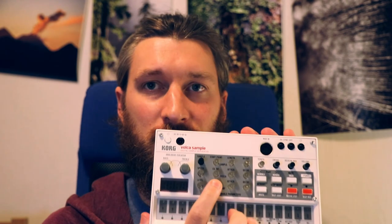There are two main compromises with using this adapter cable. The first and biggest one is that we can only record mono. There's no way to get stereo output through this because the microphone input on your phone is only capable of recording a mono signal. In terms of the Volca sample, that means we're not going to be able to use the pan knob at all, because the pan knob requires stereo. Everything else will work just fine, so you just effectively have to ignore the pan knob.